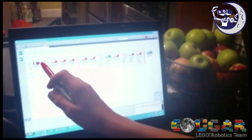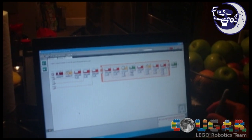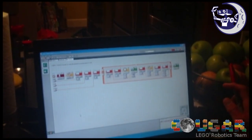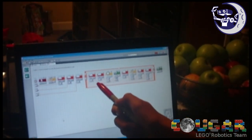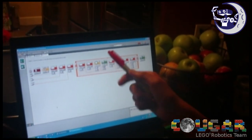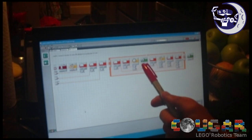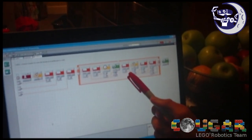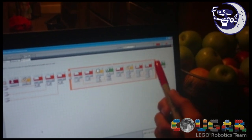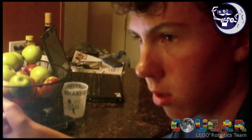Navigation can be a big problem. You can't really tell where you are without a good robot — it will need to use its own sensors to figure out where it is and where it's going. It starts by resetting the rotation sensors. Then you get three inputs: the course you want to go by compass direction, the power which is your speed, and the duration which is how far you want to go. Then we have a loop until true. The power goes to a move unlimited block, and the course you want to go is put into the compass sensor. It will tell you how far off course you are and it hooks up to steering on your motor block — so however far off you are, that's how much it corrects. It's also determining how far you've gone, and once you've gone as far as you need to go, it'll exit the loop and stop your motors.